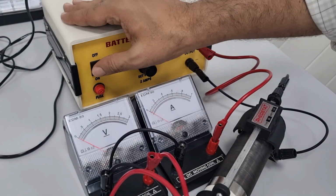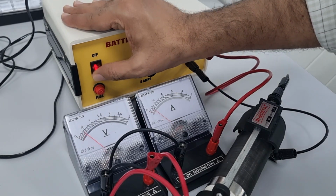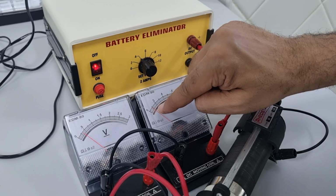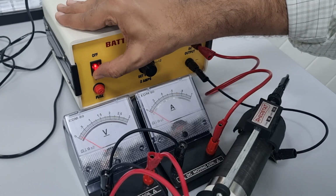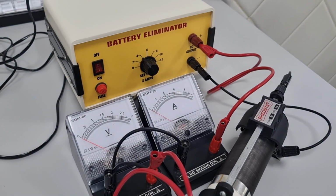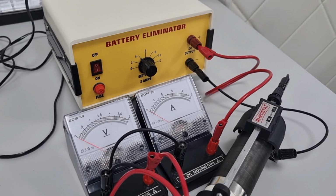Now, we take the first reading of the ammeter, switch on the power supply. Look at the ammeter normally with one eye and close the other one. Here it is 1, 2, 3. So it is 3.5 dashes. Again, it is 3.5 dashes for the ammeter. So 3.5 multiplied by 0.02 for the ammeter, the answer is 0.07.